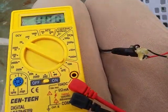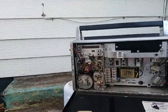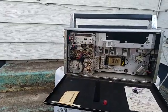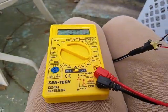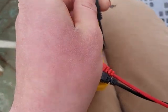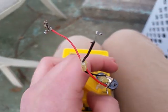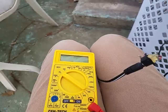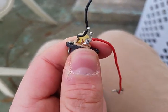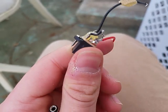That is a very good thing because I was worried there was a mechanical problem in there. Mechanically, except for one transistor I replaced up in the AM circuit, it is completely original and untouched - except for that weird mod someone put there for the power supply. I tested it with the multimeter by putting it up to both terminals, turning it on DC, and I was getting 11.9 volts. So it is the wires - the interior plastic-housed part is confirmed not to be the failure point.